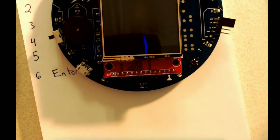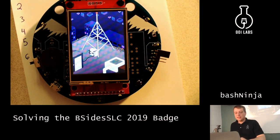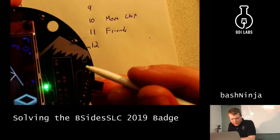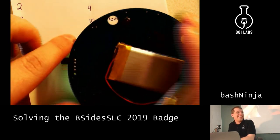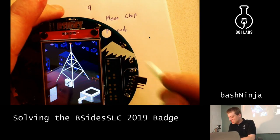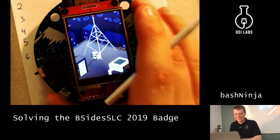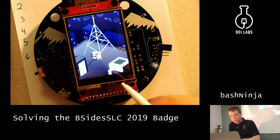Anyways. Do you think it's testing to see if the chip in the original spot on the board is removed? If you just jump the second one, maybe he'll be like, well, they didn't actually take it. I doubt it. That's just a dead spot. Because if you look on the board, there's no traces anywhere. It's not connected. It's just connected to the ground plane. Gotcha. So he just checks. Okay. So with that, that's pretty cool.